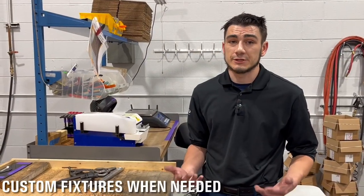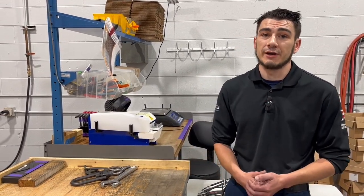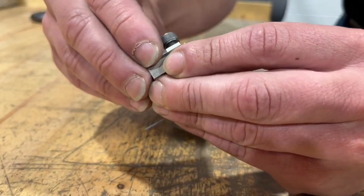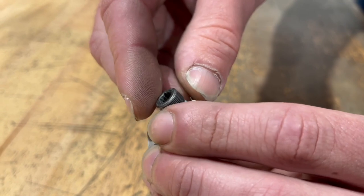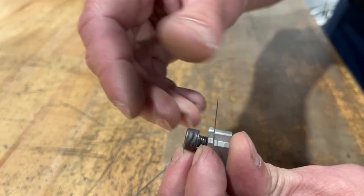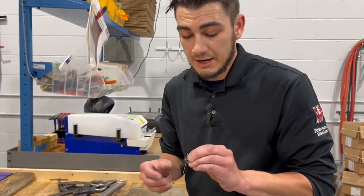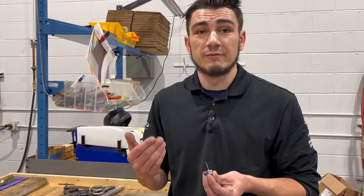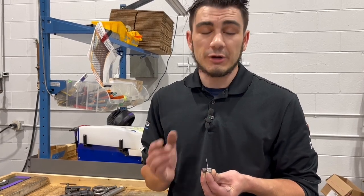When you have really intricate jobs, especially tiny ones, there's not really tooling or fixturing out there to help you right off the shelf. So you've got to get creative and innovative — sometimes you've got to make your own. What we have here are extremely mini V-blocks. You can barely see the V in there, but for a good comparison we can hold on to a 17-thousandths gauge pin. This fixture, in order to get the accuracy, straightness, and parallelism at such a small level, was actually done on a Mitsubishi MVR 2400 wire EDM machine — one of the more advanced machines in the world — and with accuracy at this level, pretty much no fixturing is a problem.